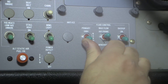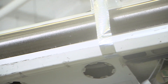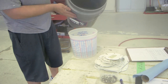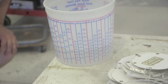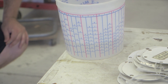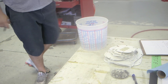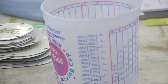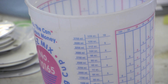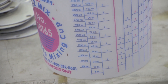Set the fluid control primary switch to the high position. Operate the system for 5 minutes. Measure the fluid collected from the left side and right side of the airplane porous panels located on the wings and struts.